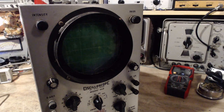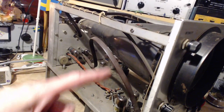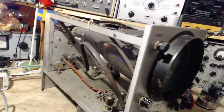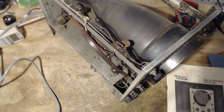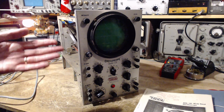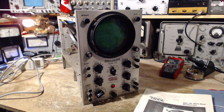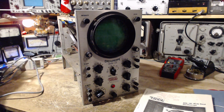It's possible the snapping is coming off the CRT itself. Some of these get high voltage connected to the side of the picture tube, others it comes right from the back as just another pin. Old color TVs have very high voltages — up around 28,000 volts. The electrons striking the glass can generate X-rays if given enough electron volt energy. In this oscilloscope, the voltage is probably around 2,000 to 3,000 volts on the screen. It's not acting up now — let's go for a little higher voltage.